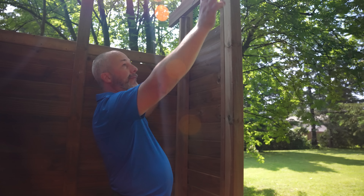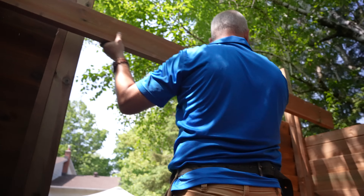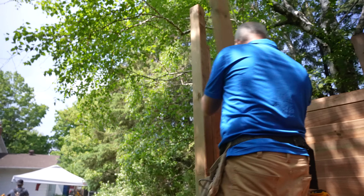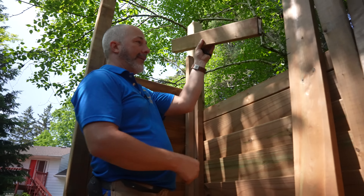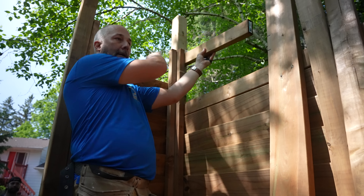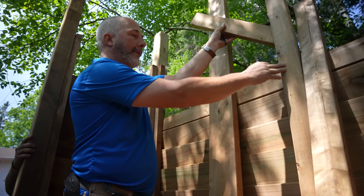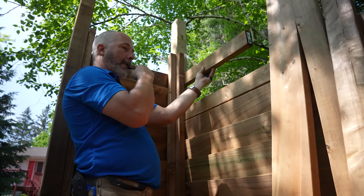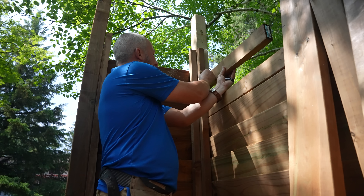In order to get the finished look I want, I need my structural support on the inside. So I've got to cut away my extra two by twos so I can get this set at the right height. When we're all said and done, I'm going to have a two by four coming in behind here, all the way to the ends. That two by four will travel behind this board on the same face. So I'm trying to take my measurement for my new header from this location right here.